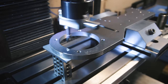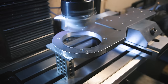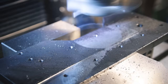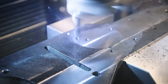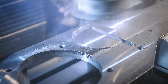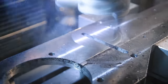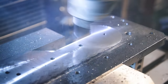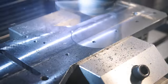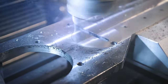It's time to face the two flat sides now. I'm repurposing the same boring head as a fly cutter. I first started doing this using a big face mill and was getting some really bad chatter and an awful finish. I'm still getting some chatter even with this setup, but it's way better in comparison. The problem is that this part is pretty thin relative to its overall size, which means it has a tendency to vibrate when you cut it, creating chatter. I don't really have a way of clamping it that completely eliminates that, so I still didn't get a perfect surface finish, but at least one I can live with.